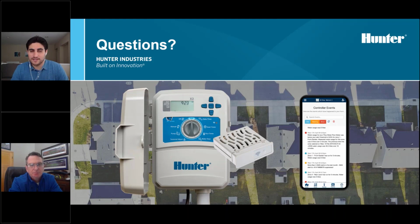But if you want to use a standalone X Core, have no desire to connect it to the internet, but you still want it to be a smart EPA WaterSense approved controller, you can still go with the X Core, indoor or outdoor. We got 2, 4, 6, and 8 station options available, and then you can wire in that physical wired or wireless solar sync sensor for those on-site smart adjustments. So we do anticipate the X2 supplanting our X Core market in the future as everything's moving to internet connectivity, but there is still the X Core out there for that on-site standalone controller with the option for a physical solar sync sensor. Awesome, that's great.